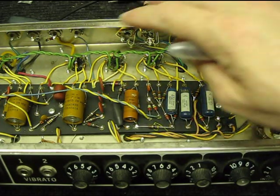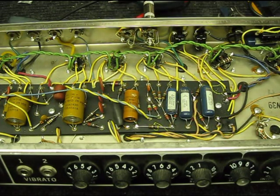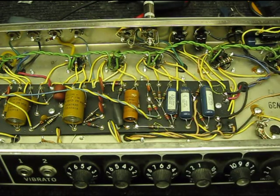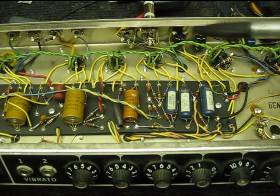Those have to be changed. This is also why most technicians make mistakes with these amps. Typically when I work on this type of amp, I don't want to change everything that normally gets changed, simply because you'd like to open up the amp and see some of the original stuff. There's no point in buying a 50-year-old amp and having 100% new parts all the way through — a completely rebuilt amp probably isn't going to sound the way you expect.